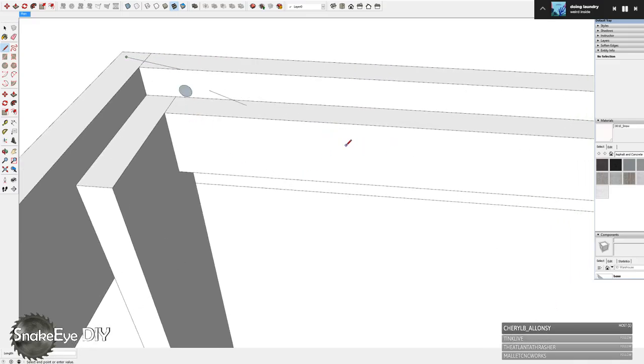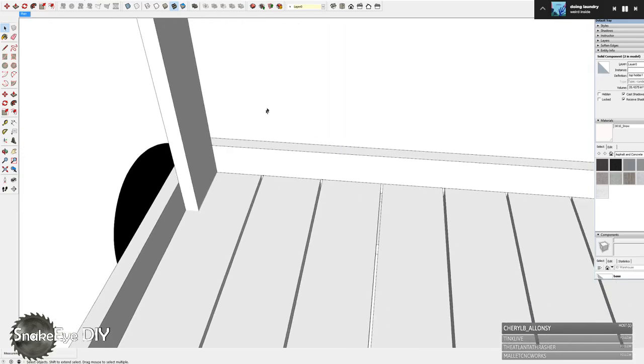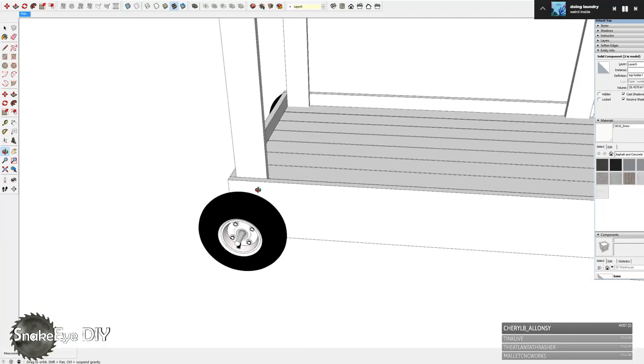And then for this part, it's only holding the top in. So I would just put screws straight through. You wouldn't have to do pocket screws there or for this one. It would just be to hide these corner boards. And since these ones are longer, you'd probably put 3 or 4, and you'd make sure to glue these ends, because that's going to have a ton of structural strength. And just those 4 1-bys going up will be enough to support the weight of the top layer. I think it would be fine.